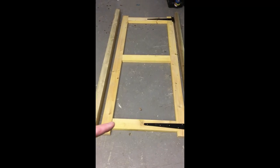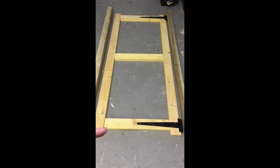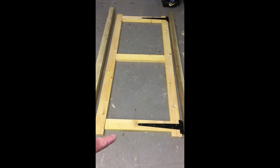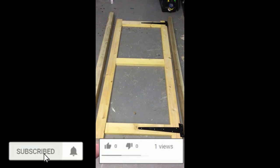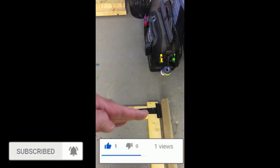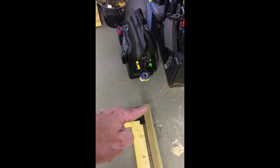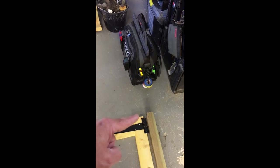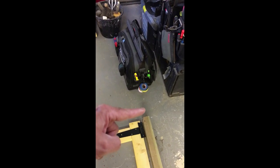All the timbers are cut for the gate. I've just dry laid it out here to show you what I'm doing. Here are the sides of the gate and the bracers. I'm leaving this one up slightly in case I need to take a bit off when I get it in position. This one will be centralised, and this one here is going to be sat down slightly so the hinge is hidden when it's fixed against the post.